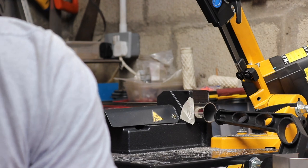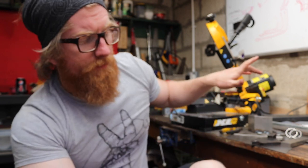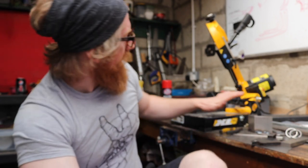So I'm going to cut another five just to test my theory of the centre line radius, and then I'll tack them together on the bench, because I'm not quite at the position of cutting everything off on the bike. Once I can get these 10 tacked together, I'll take them over to the bike, and we'll take the camera over as well. If I'm pretty happy with the centre line radius, I'll be in a position, I think, to just go and keep cutting as many as I can.